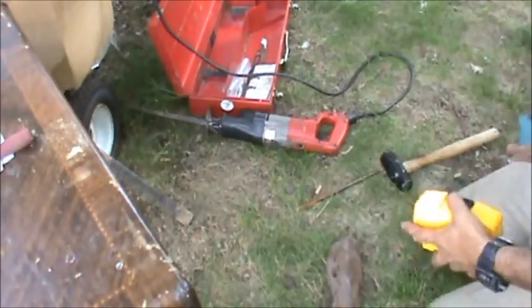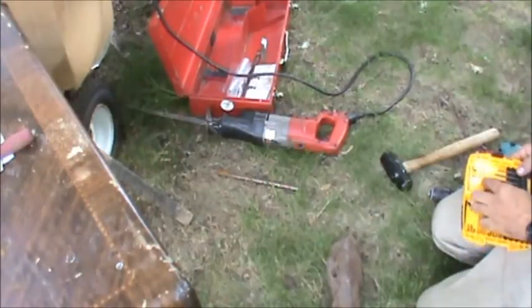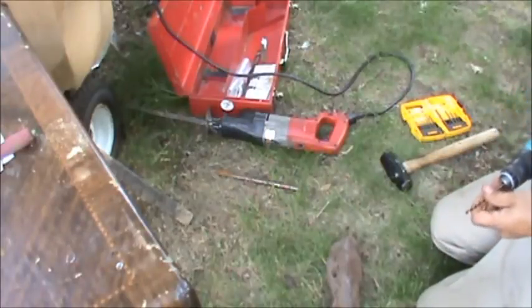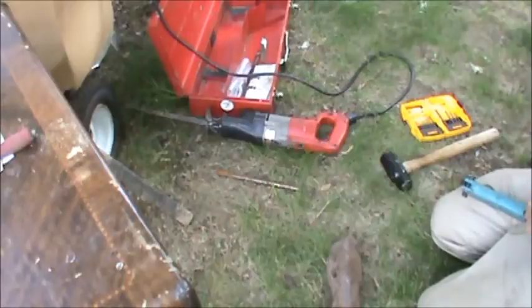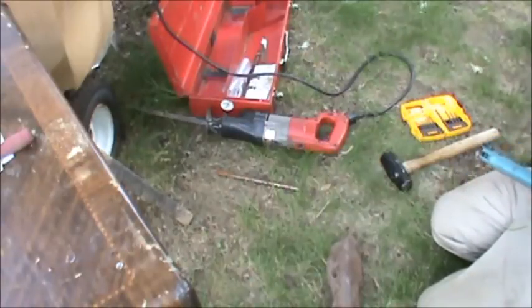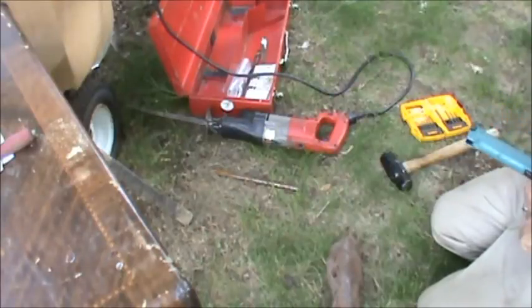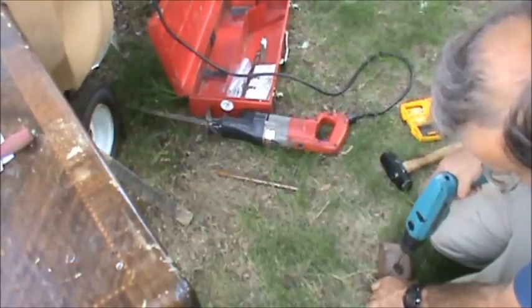Everybody's saying something about drilling it out. That would probably be a lot easier than screwing around. These are 3/16 inch drill. A lot of times those heads are on there so poorly that you can drive them out and bust them up with a chisel. That one seems to be stuck on there pretty good. So we'll just do this the smart way instead of messing around. Start in a corner.